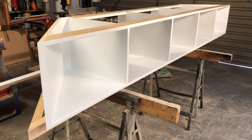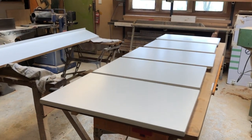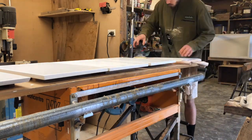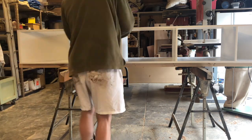I'm super happy with the finish I've been able to achieve on the first coat of paint — everything's looking really nice and uniform. I gave all the parts a light sanding with 240 grit just to knock down the high spots, which really improves the quality on any painted finish, and then it was on to the next coat.